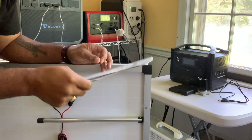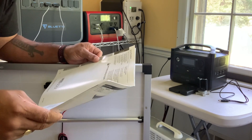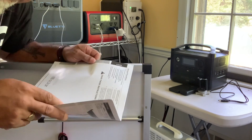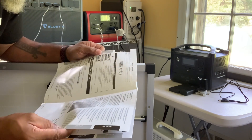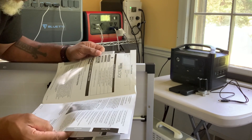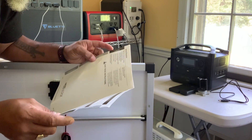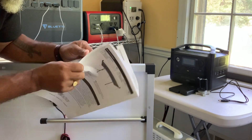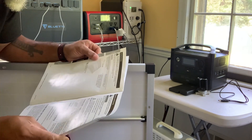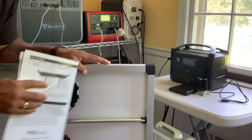What I'm noticing here is this is a 100 watt panel, but I need you to be careful because this is also 24 volts. So if you plan on hooking this up in series, you really want to take that into consideration — you might burn something up. So 24 volts, 100 watt panel. Let's go get it hooked up.